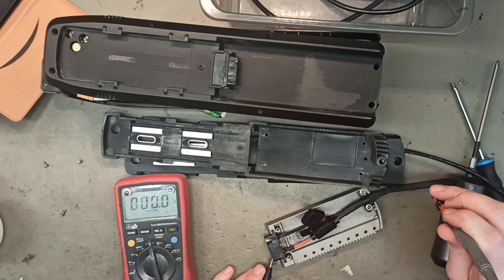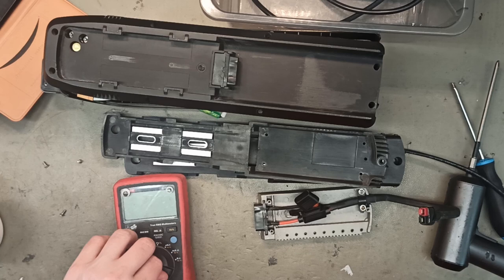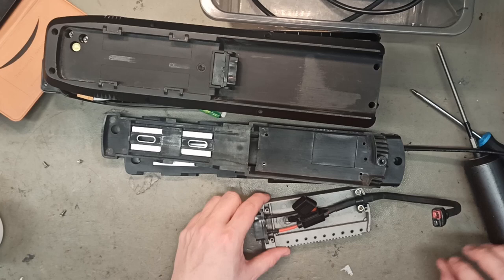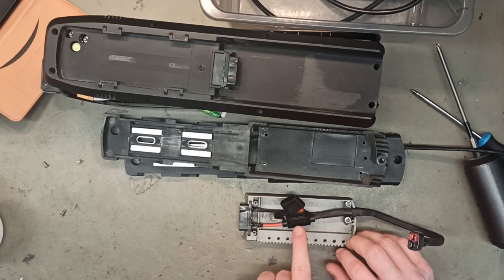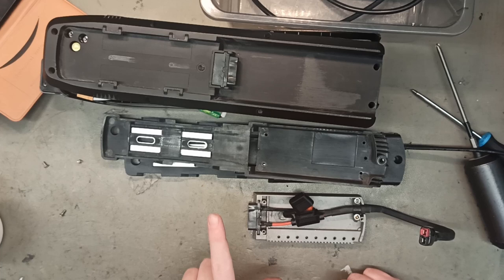Zero ohms — and the black one as well, zero ohms. Since I scraped it, it's hard to diagnose if that was the only problem, and we'd also need high current going through this to be sure. The biggest problem I see is the fuse — I would start by replacing that because it's the cheapest fix. Then I would go for the connector, both in the battery and on the holder side, and that's going to be expensive. This connector is expensive to buy and quite time-consuming to change.